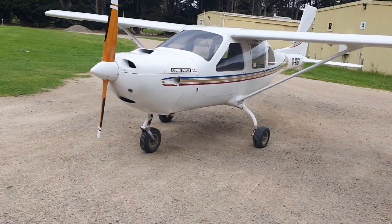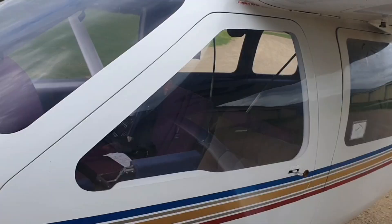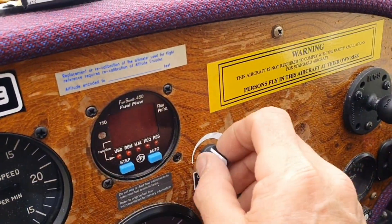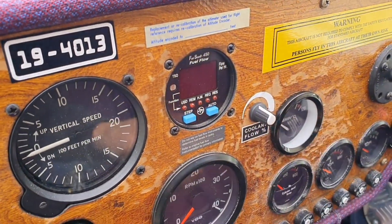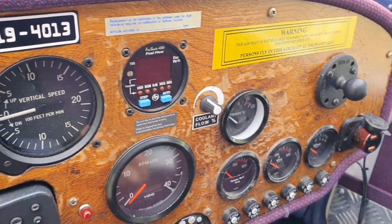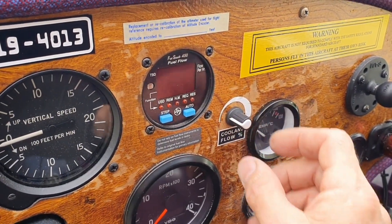The prop is balanced and running well. I've put a little gurney flap on there as well. Inside the cockpit I've added a potentiometer which controls the speed of the impeller. The beauty of that is you can control the temperature somewhat. Once you're flying and at speed there's lots of airflow through the radiator, so you don't need much water flow — you can dial the amps right down so you're not drawing too much current or wasting energy.